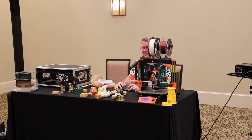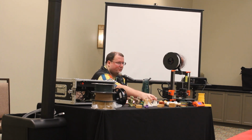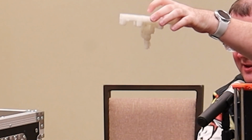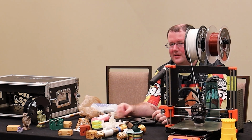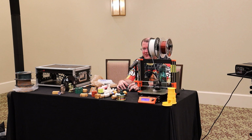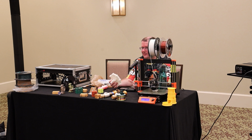Yeah. Now the print software does a pretty good job of adding temporary material that is meant to snap off once it's done printing. So let's say you tried to print this thing upside down here, it would add a ton of material around here and here and all over the place, and then you would basically remove all that material. If you've ever built a plastic model on the little runners, it's kind of like that. If you've ever played 40K, you know this feeling of cutting them off. But ideally, you want it to print without needing those supports, because if you care about it, they do tend to leave a little mark, and you are wasting a little bit of plastic and it takes a bit more time.